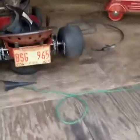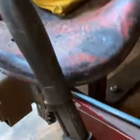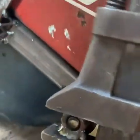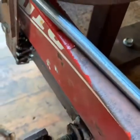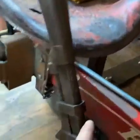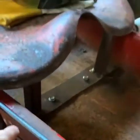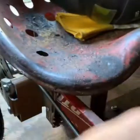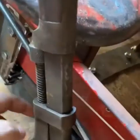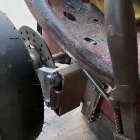Now, playtime's over — back on the wagon. Now I'm gonna change this old pipe wrench over to a brake lever. I welded the bolt and the nut, so that's on; I feel comfortable where it was at. Now I'm probably gonna make a bracket, weld it right here, turn this up, then drill a hole on both sides of that bracket with a little pin so it'll sit in place. Probably put a spring hooked up right here and turn this back — we'll see if I'm gonna break this up.